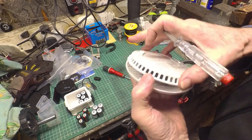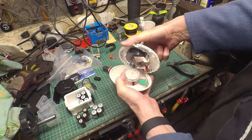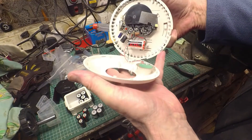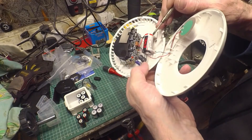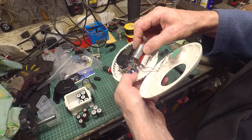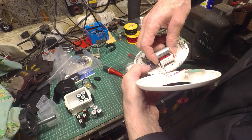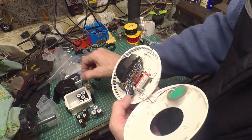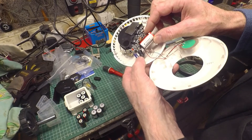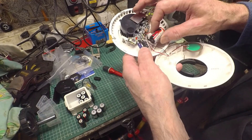Now if this comes apart, maybe I can just change the battery, assuming it's a replaceable battery. There we go — it's a CR123 type. It's welded in, but it says 17335 on it. Looks like a 123. This is what I just happened to have. It does look to be the same size to me. It's supposed to be three volts — sure enough it says three volts on it. Never heard of 'Eve' as a brand. I could replace that, I think.